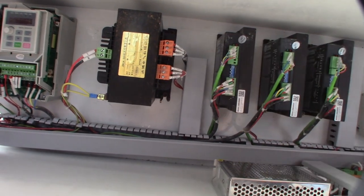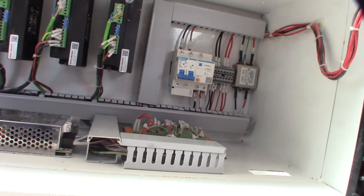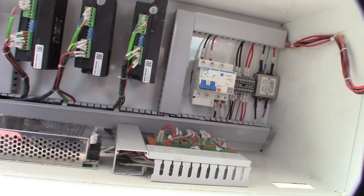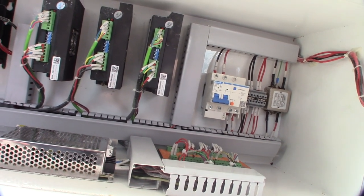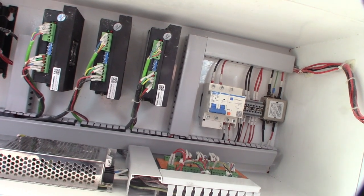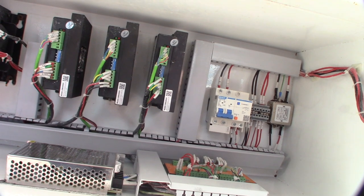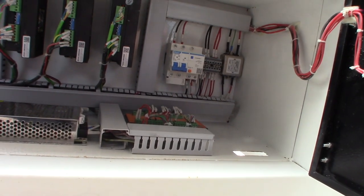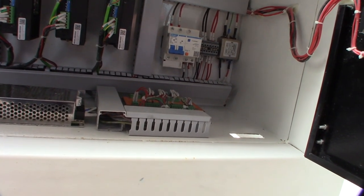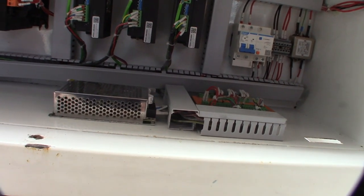So 220V in, 70V out - but these steppers are not closed loop, which kind of sucks. Eventually I'll probably upgrade these to closed loop just because material is so expensive now. If you mess up a piece of aluminum, that could be like $30 or $40. I'm going to be taking this and converting it to LinuxCNC or Mach 3 because I actually do have a lot of extra controllers from other projects, so I'm trying to keep this on a budget.